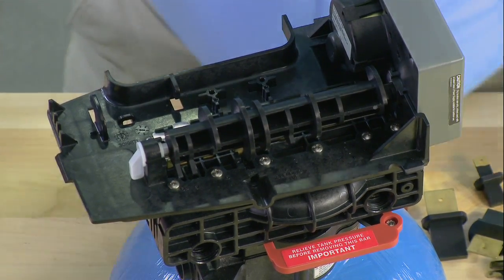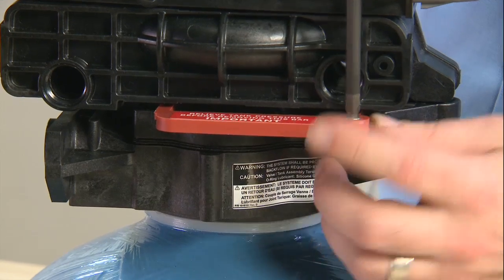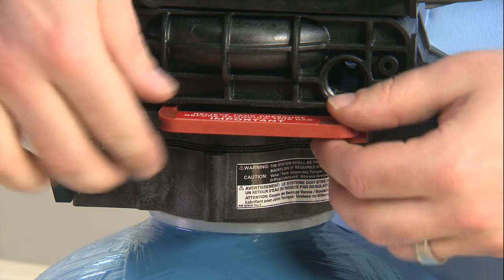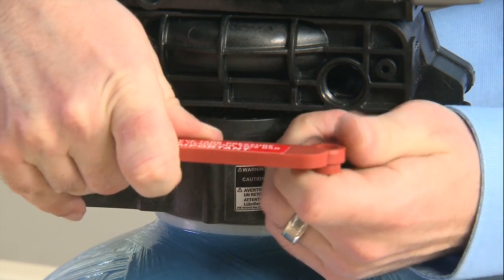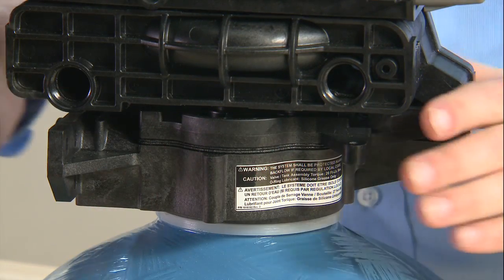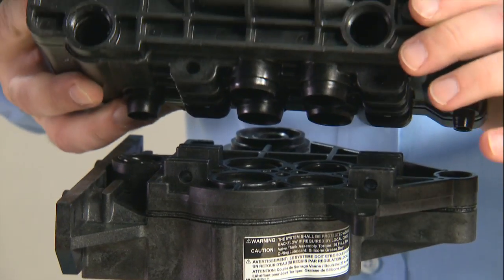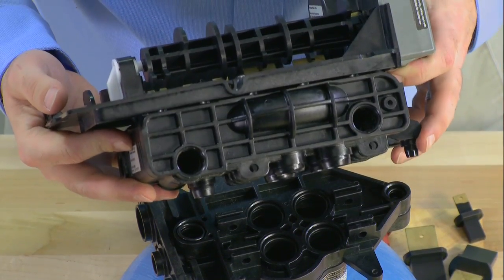There is a service assembly for the 255. If we remove this screw, we can then remove the red clip, pulling forward. This is what is called a K255 service kit. The whole top plate assembly — which is the timer, cam, and all of the flow controls — would come in this body assembly.